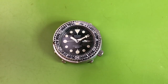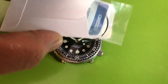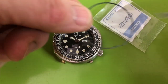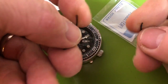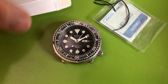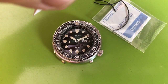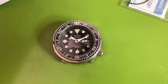And there we are. Good to go, man. There it is. We had, I don't know, usual parts. It's interesting to pull this stuff apart. This is the packet for that nylon seal. This is your rotating ring seal. It's like uncooked spaghetti. It just shatters. It's always nice to see old things like that. Your old crystal and day wheel and jacked up crystal seal are in there.